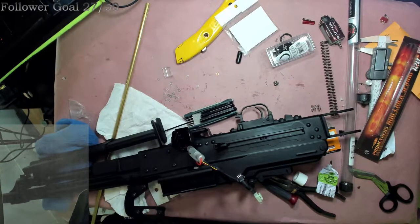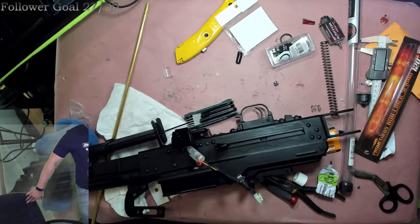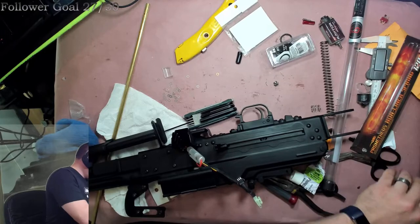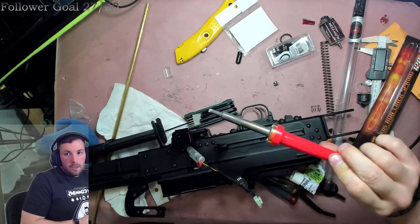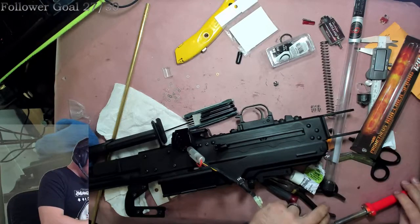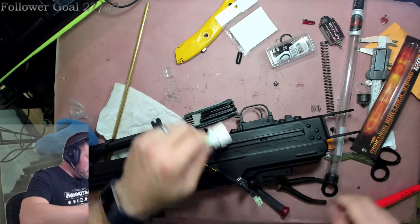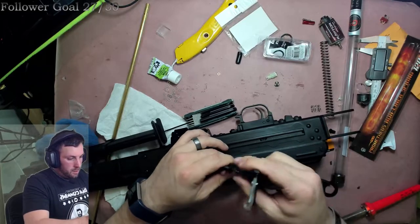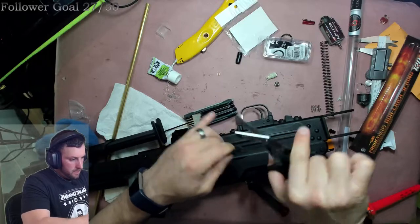So, soldering a Dean's connector, the biggest thing that's going to give you a hard time is if your soldering iron is not good. So I have a 40 watt, is it? Yeah, 40 watt Weller, right? Thing's cheap. But it gets hot enough to do soldering for this kind of soldering, so that's pretty much just what we need. So a lot of it comes down to prep. The difficulties that you're gonna have are gonna come down to whether or not you prepped well or not.